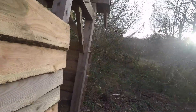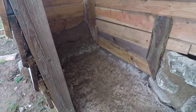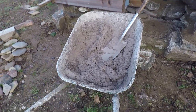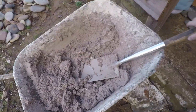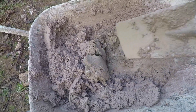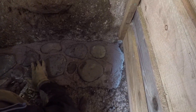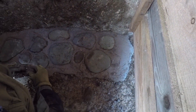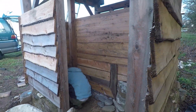The subfloor is all nice and dry in here. We're going to put pebbles on top of that with the lime that I got for free, so it's all free, which is good. This is a natural hydraulic lime NHL 3.5 - the stuff I got for free. It was going off, getting a bit old, but it's mixed up fine, it's great. We're making that into a nice mortar with natural water, and then Dot is just getting the hang of laying them down. We're just going to lay them down like that, kind of like tiling but with pebbles - lay a bed underneath them, then fill in between like grout, and then wire brush them afterwards.